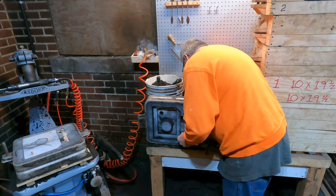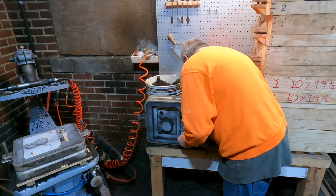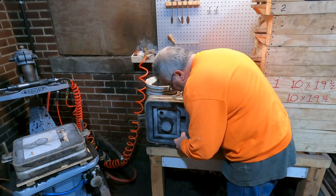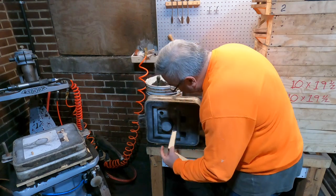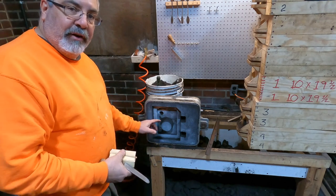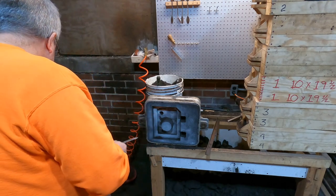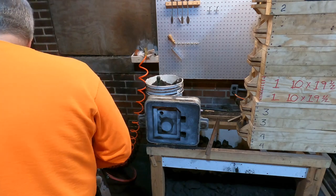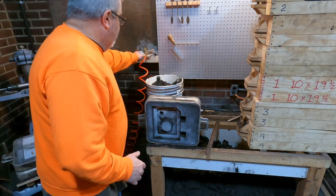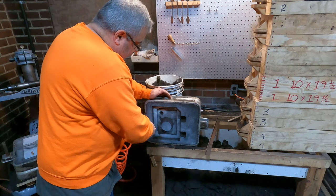Okay, so this one actually came up off the mold, which is fine. No big deal, we still got contact. So there's that. So this is a good mold. I have this little pop-off riser here. It's looking like it's going to be over-gated, hopefully. But it's better to be over than under. Hopefully we want to try to do this once. We'll see how it goes.